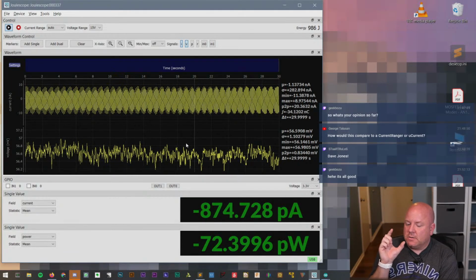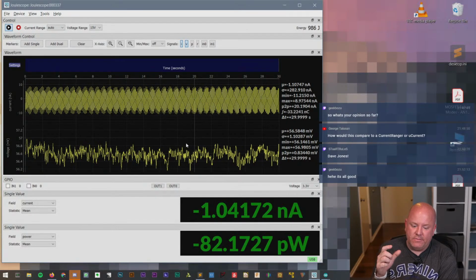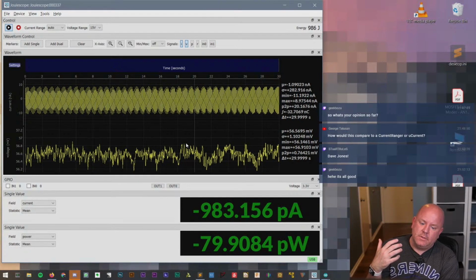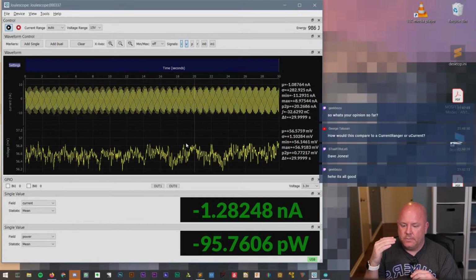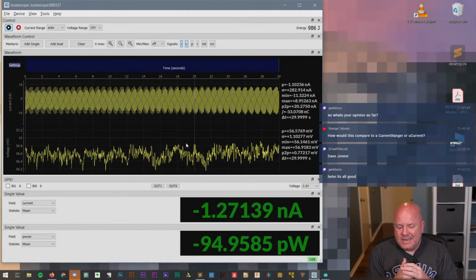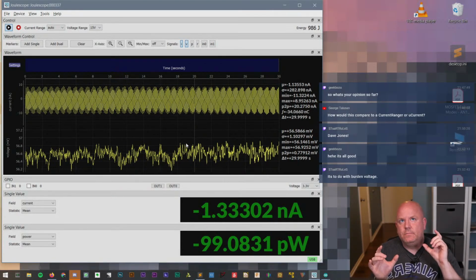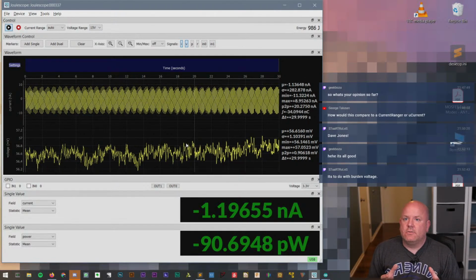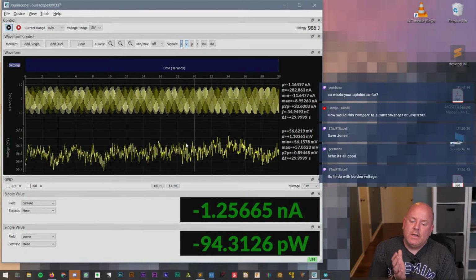I mean, the closest that comes to this to me would be, you would basically have to have an oscilloscope and something like a microcurrent, but then you'd have to have something that can range between nanoamps and amps. And that's a hard piece of equipment to find that can give you decent resolution on both sides of that. So for characterizing the power consumption of a device, this does very well.